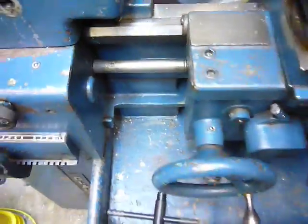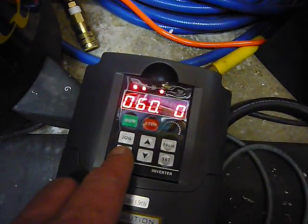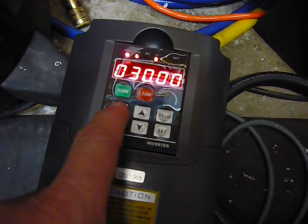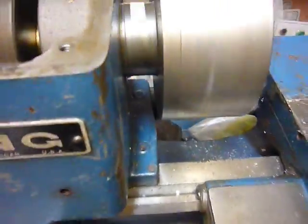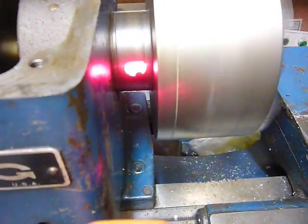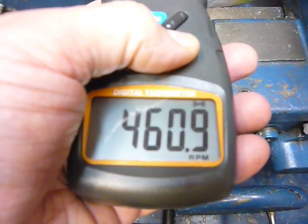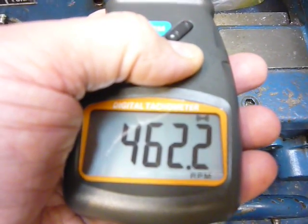930 to 934 RPMs at 60 hertz. Let's come over and jog down here a bit, heading down to 30 hertz. Looks a little rattly in there — a little harmonic resonance it doesn't like. Come back in here again: reading about 460 RPMs. It's not quite an even ratio of what I was expecting from before, but pretty close.